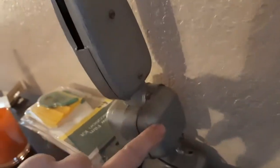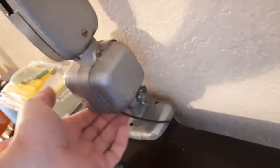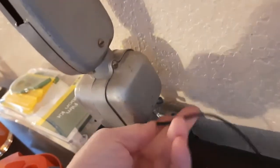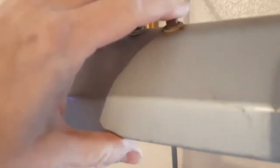Basically what I did: I took the screw off, took it out, removed all the wires from this area down to the plug, and put in my own power supply. You can see it's a Netgear router power supply from the thrift store — I think I paid about two dollars for it. It's 12 volt. The stock wires are still in there up to the stock switch, just a simple on/off.